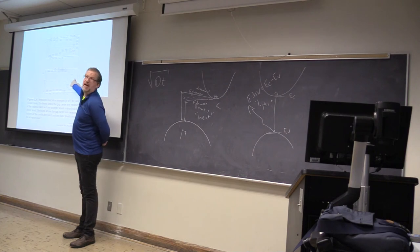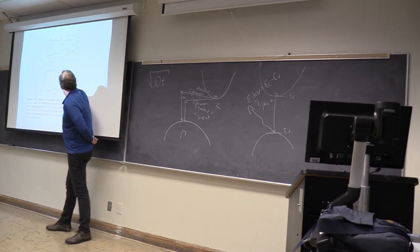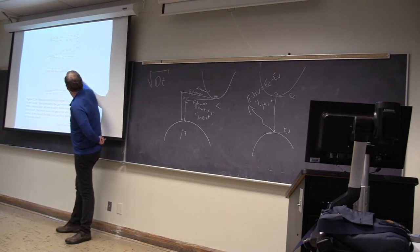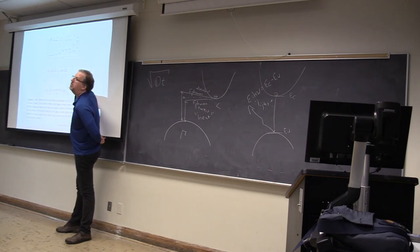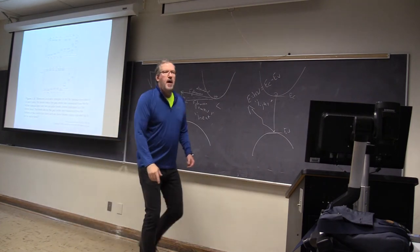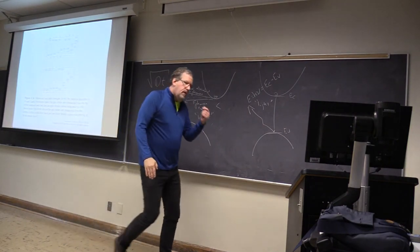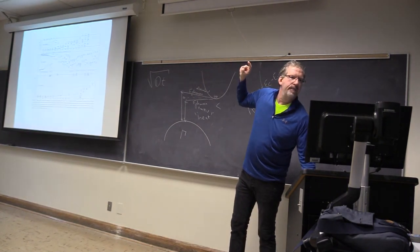This chromium is not going to donate an electron anytime soon. See how deep that is? It's not shallow like these up here. This is deep. That's going to need a lot of energy to release. It's 0.63. Right? That's huge. That's past green. That's almost into the yellow, I think. That's a very high energy difference. So that's not going to release and deliver the electron I need. I need shallow donors, I need shallow acceptors. Because this is how they created the free carriers that I need.